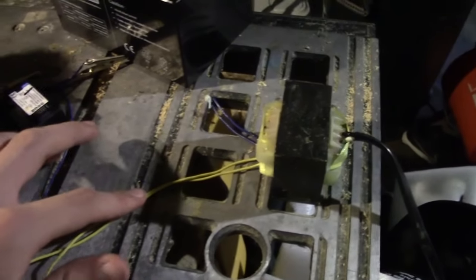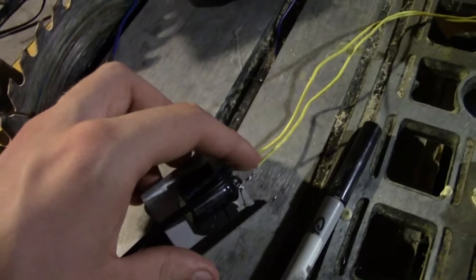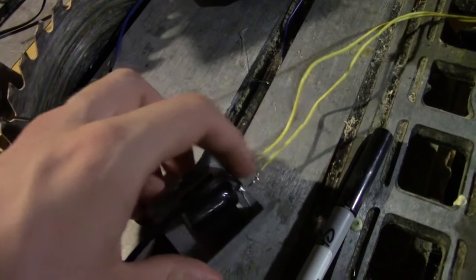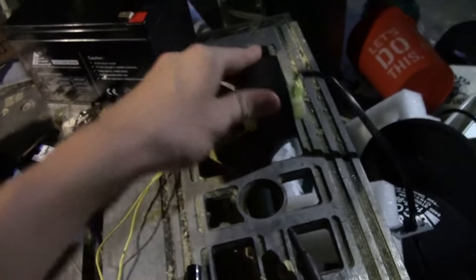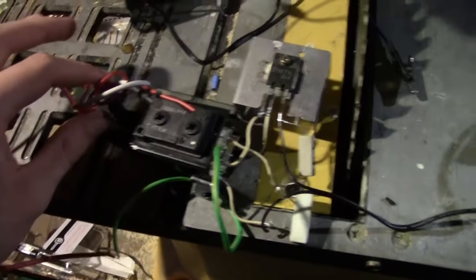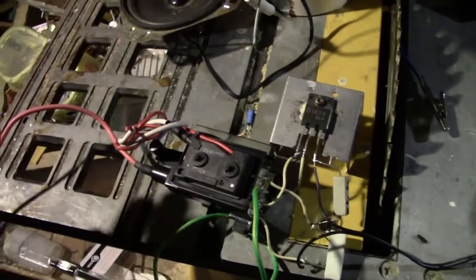I salvaged this old transformer from an audio player — it outputs 12 volts. I also scavenged around on a couple more boards and found a rectifier and a capacitor to smooth it out, so I'm getting about 18 volts DC at probably about two amps from this power supply. That's enough to power the flyback driver we just made, so we have the whole high voltage power supply setup completed. If we plug this in, we should get sparks.